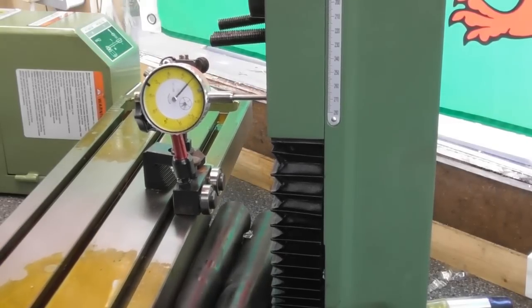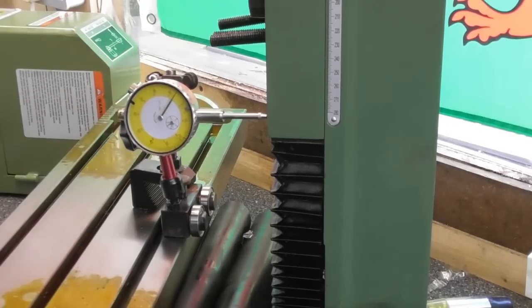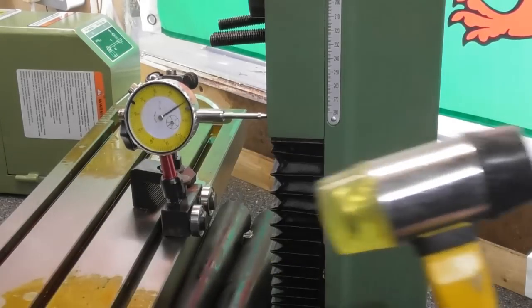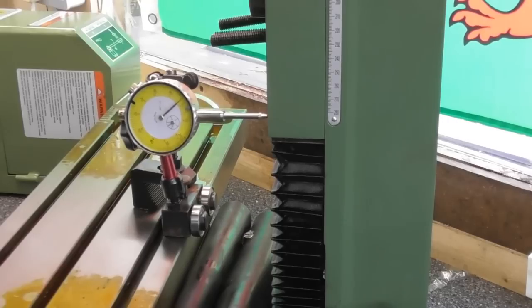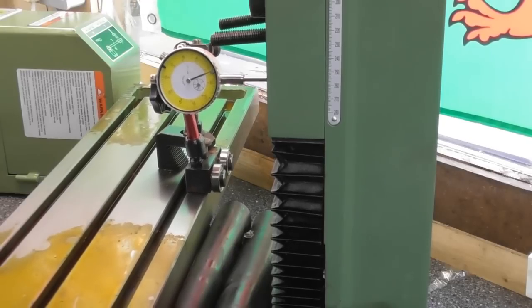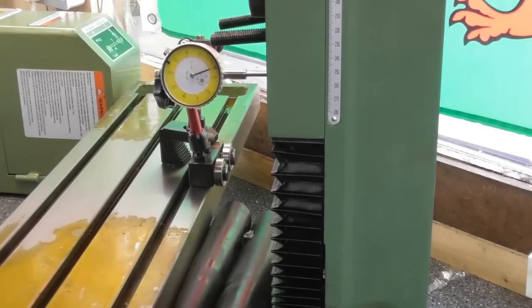You can see the clock is still falling — about 0.07 on the clock. So I'll just tap the back corner again, using a nylon-based soft mallet as you can see. From experience of the last time, I'm going to go a little bit past the zero for luck. Just re-zero that and back the other way again. I think we're halving the error every time — 0.04 millimetres, so you're talking less than two thou now. So I'll continue with this procedure.